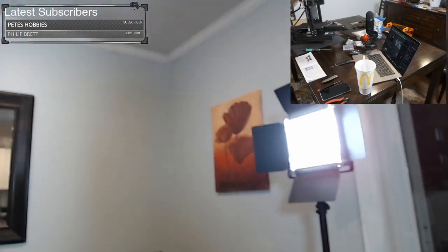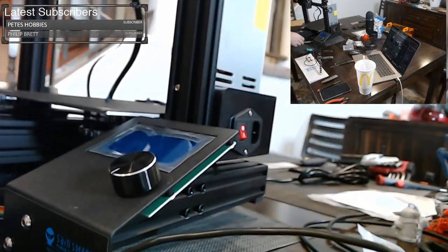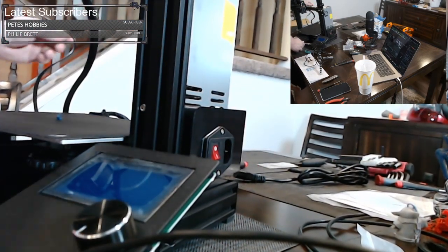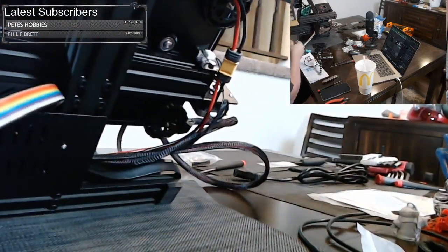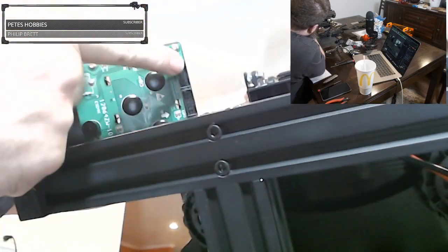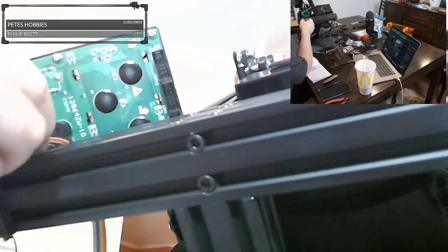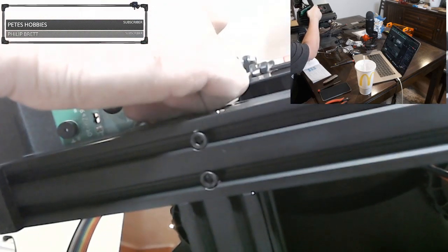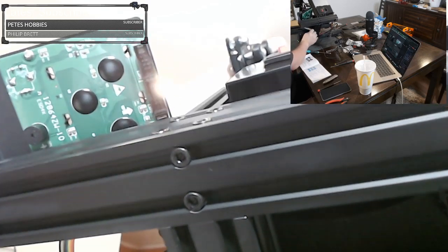And we'll rotate the printer. We didn't do this wire. This is in the manual. This wire right here hooks up to port number 3. So when you look under here, oh, there went my blue clip. When you look under here, these ports are numbered. This is number 1, so the last one's number 3, and that's where we want this wire. So let's get our wire up here and plug it into number 3. It only fits one way, and you just want to slide it on there. It doesn't clip in, it doesn't click, it just goes in.